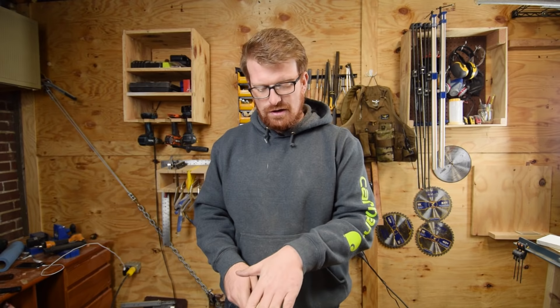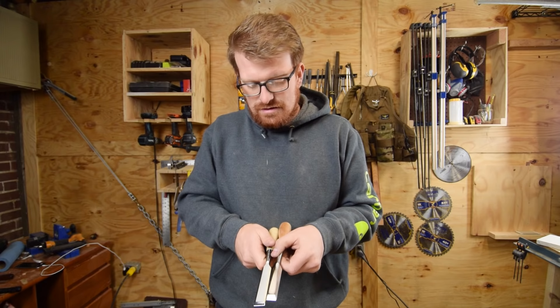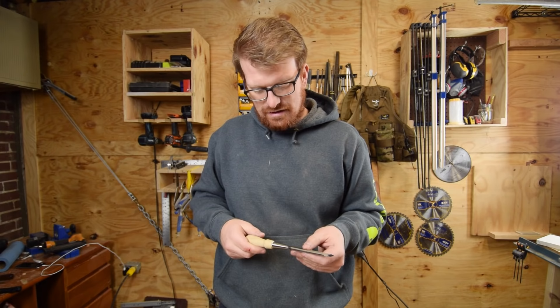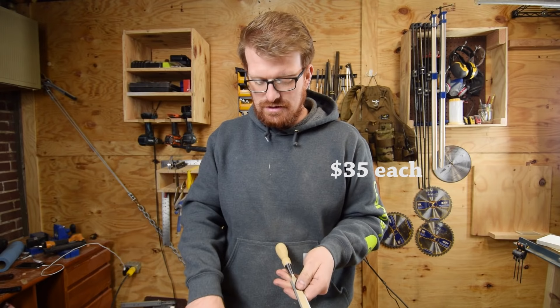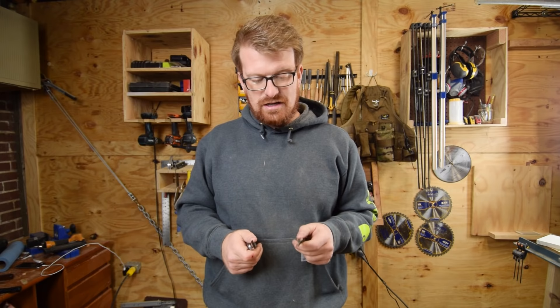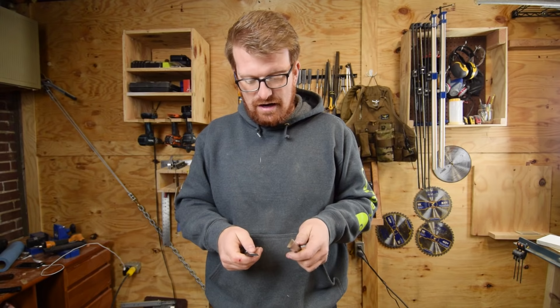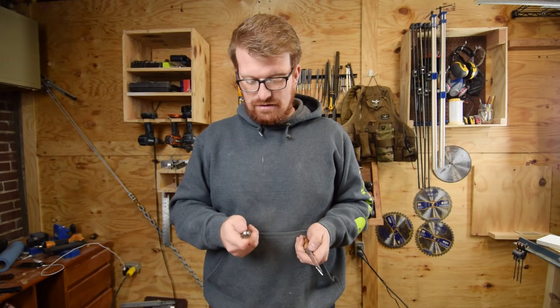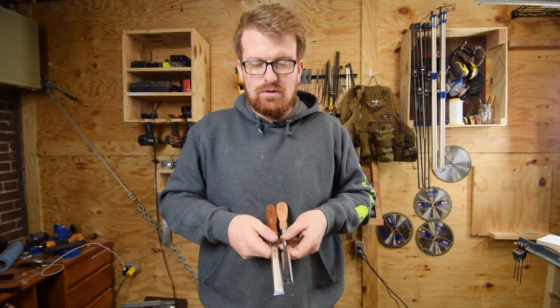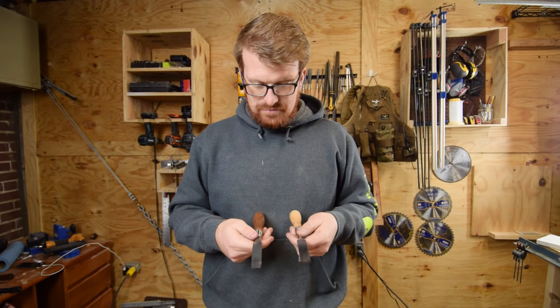If I were to upgrade from the Aldi to something a little more precise, I'd look at the Stanley Sweetheart. It's got that classic socket chisel design, and it actually has a slightly longer blade than the Lee Nielsen-inspired design, which can be nice for paring activities. Still a lot pricier than the Aldi, but probably worth it — easy to flatten, comes fairly precise from the factory, and good to work with. If I were to pick a lifetime chisel, it'd be a tough bet between the Lee Nielsen and the Veritas. They're both very strong steel, very well manufactured, with totally flat backs right from the factory — basically sharp out of the box. The couple of edges I'd give to the Veritas: the blade is a little bit longer, making it more utilitarian, and the handle is just a little more comfortable in my hand. I don't love that old socket chisel feel, but that's just me.